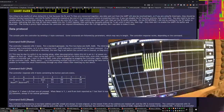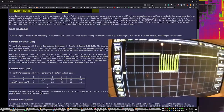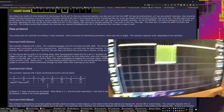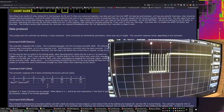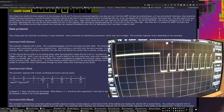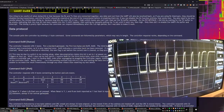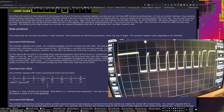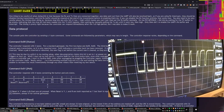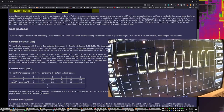These bits here are, well, one, out of focus because I don't have an auto-focusing webcam, so that's a thing. These bits are still curved over. It might be that I have inductive loading on the probe, but that's probably unlikely. I'm going to guess that there's something wrong with the actual circuitry. At this point, I would think that that is caused by loading on the actual circuitry of the USB board itself.